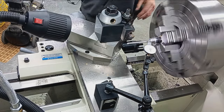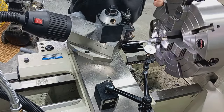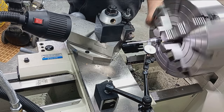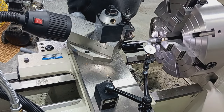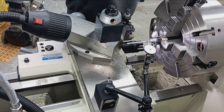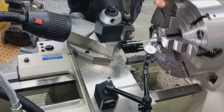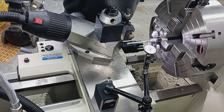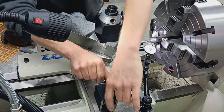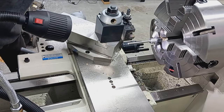Okay, it didn't move too much, but enough to make an adjustment. And maybe snug these jaws up just a bit more. Oh yeah, I got a little bit loose. So we're going to go a little bit past this time just to crunch down a little bit more on the jaws. Those brass shims probably relax a little bit. That's why I always check. There we go. Happy with that. That's why I keep my indicators at close reach, set up, ready to go.